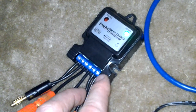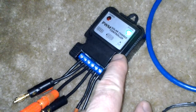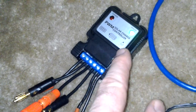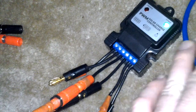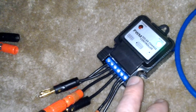Normally I wire everything straight off of the battery, but this is a good fail-safe for you. The reason they have these is at a certain voltage — I think it's 10.5, which honestly is lower than I'd ever want to run a battery — it does protect the battery a little bit whenever it cuts off the voltage. For instance, if you're out of power for some number of hours or days, it would get down to about 10.5 volts and then it would just turn it off, so it would kind of save your battery.